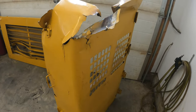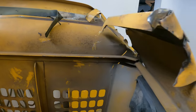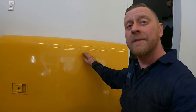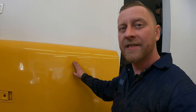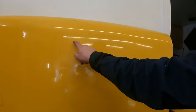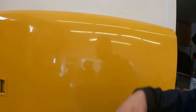This here is the main hood cover. As you can see it is in very bad condition — there's cracks in the sheet metal everywhere and the braces are broken. This needs a good amount of work. This panel here covers the hydraulic pumps on the cab side. I never actually put this on just because I had an overheating issue, so what we'll do is cut out some panels for the air to flow through and cool that pump.